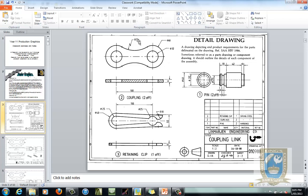You'll see here that this radius 75 has a broken chain line here, meaning that the center is not there, it's somewhere out in space, but it can't fit on the drawing. These little dashes here, they indicate that these curves are meeting at a tangency, or a point of tangency, which means this curve is touching this curve, but it's not cutting either of them. So with that in mind, we'll go across to Creo, and we'll probably start with the circles first, and I'll show a few techniques. So just remember 32, 60 and 100.